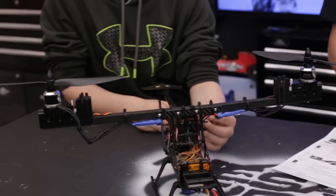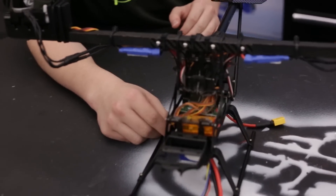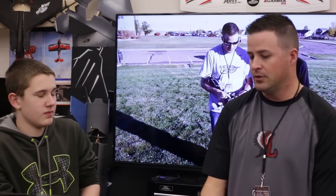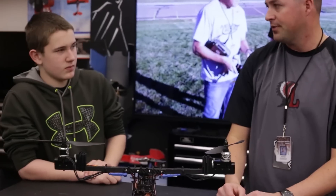The build was really hard - we couldn't find a dual connector to connect two ESCs together, and we couldn't figure out why the KK2 board wasn't working at first. But once we got our hands dirty and figured it out, the second time rebuilding with new equipment only took about 15 minutes. Swapping the servos isn't a huge process - you just cut the two tabs off, pull it off, get the new servo on there, do the two new linkages, and you're fine. Other than that, it was a cool project to do together. Here's some flight footage.